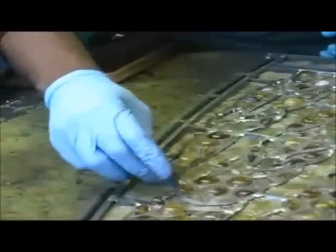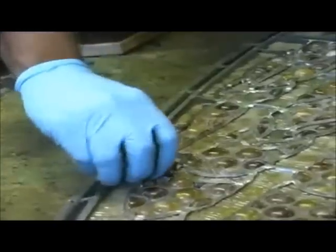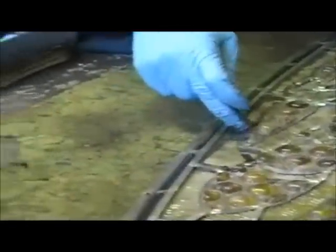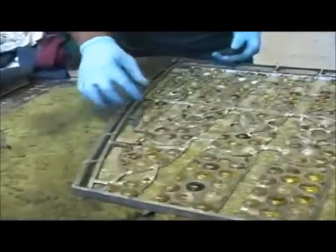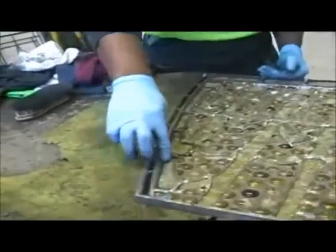The excess that's oozed out will have a pick that is used to go around the window to remove it. Any of the oils or residues that are left, we will use this whiting compound mixed with a little bit of lamp black that will help remove the oils from the glass. This is the second to last process in the studio, done prior to the reinforcing.